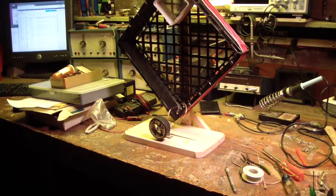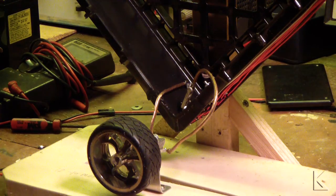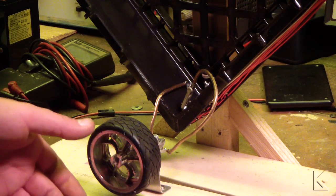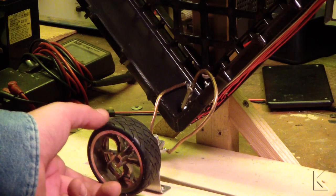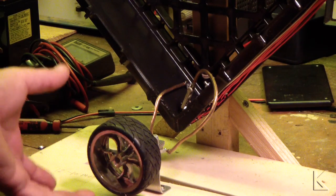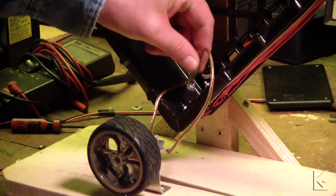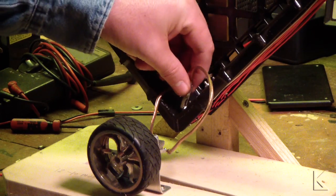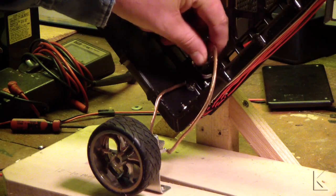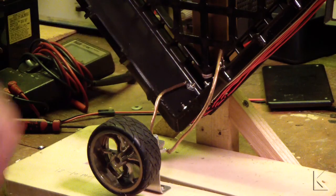So, on the base, there we go. You can see we've got a tuning capacitor, and yes, that is a wheel off of a radio control car. It makes a nice way to tune the cap in small increments without getting too close to it, although my hand capacitance will still affect it. That's just what I'm going to use. But you can see in here we got an alligator clip, and I just move it. So now, well, out here the loop is 6 turns. 5, 4, 3, 2, and that screw would be 1 turn. So I can just tap the loop where I want, make as many turns as I need it to be.